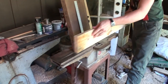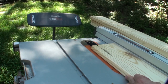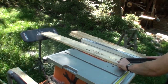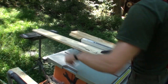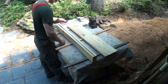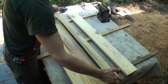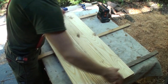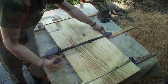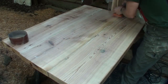While the wood filler was setting up I measured for the shelf. I'm using those same one-by-six untreated decking boards — first I join one edge and then rip them all to equal widths to make the shelf the size I want. I'm using my Ridgid portable table saw here. These are just glued up with no biscuit joints or anything like that; it's a strong enough joint and not under any stress. I don't use biscuit joints unless I need them for alignment purposes — something like this glues up and dries in maybe two or three hours.